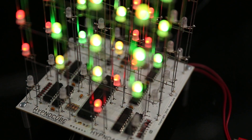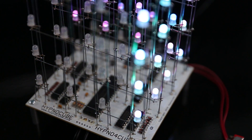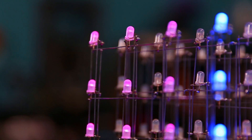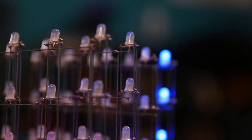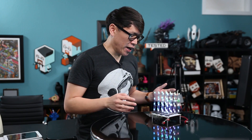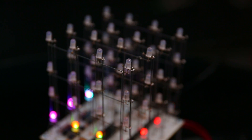What you get is all these LEDs in a bag. You get the PCB — the chips aren't even soldered in, so it's a lot of soldering. Over the course of a week, I built a jig and put the LEDs in the jig. Each of the LEDs have four pins: red, green, blue, and a ground, and each of the pins have to be bent in a certain way. Then they get soldered onto these steel guide cables. A little bit challenging, but after a week of building, this is magnificent. I love this thing.